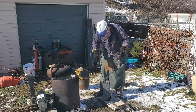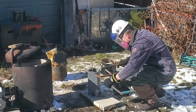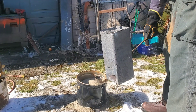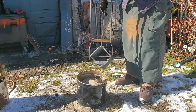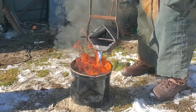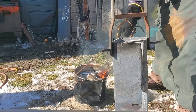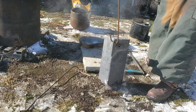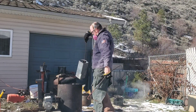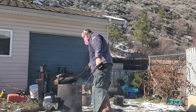I've got this aluminum a little hotter than I'd normally pour it for regular sand casting, because the foam is going to take some heat away as it burns and gets replaced by the aluminum. Let's focus and pour this out. You really want to make sure that cup stays full the whole time. To tell you the truth, even though I have a mask on right now, it's not really doing a lot because it's the wrong type of mask — we'll cover that in a couple minutes. I'm going to knock all that slag out of the bottom, throw that back in, then dump the sand out and have a look at how everything went.